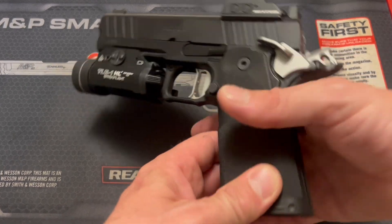It's not going to actuate on accident but it's not difficult either — and that is the way it should be. Now when it's on fire it doesn't move. The original safety when it was on fire I could still push it down and it would just jiggle and be mushy, which drove me crazy given the money and time I put into this gun. And that side would walk out the more I used it. With this one, neither of those is an issue. The one other fitting step: I put the male end in a vice and slowly cranked it until it held onto the female end correctly, then reinstalled it — absolutely perfect.